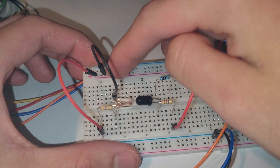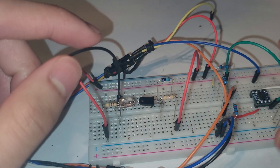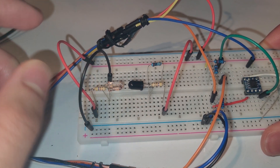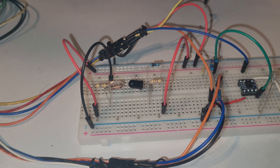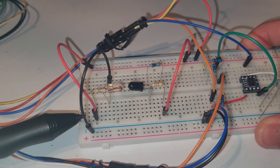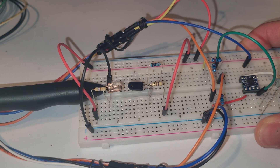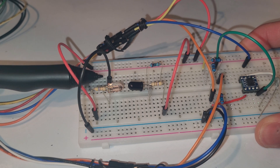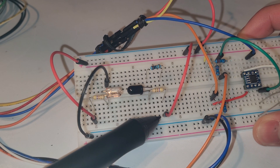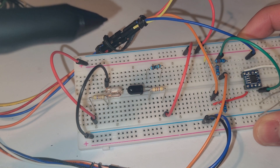I just realized I had the grounding wire going into the power wire — that would be really bad. So I'm going to take this and my grounding rail here, which is the bottom negative rail, and plug it in correctly. The current flows through the red wire, through the resistor, into the infrared LED, which emits infrared light that the phototransistor picks up, and then the leftover current flows back into ground.